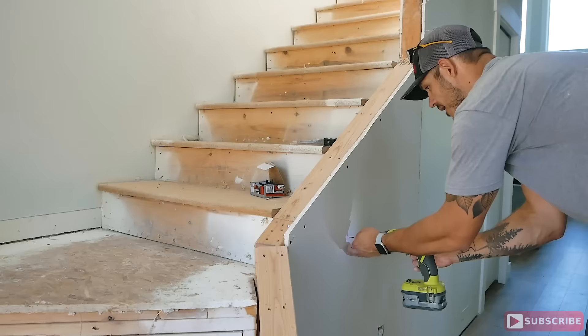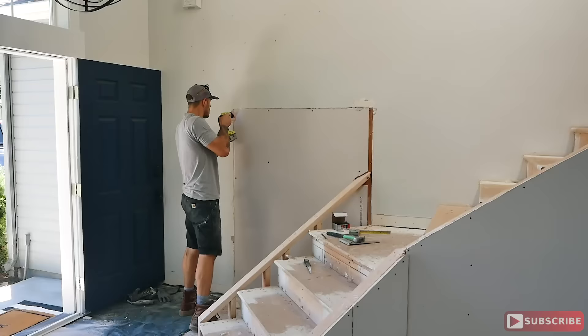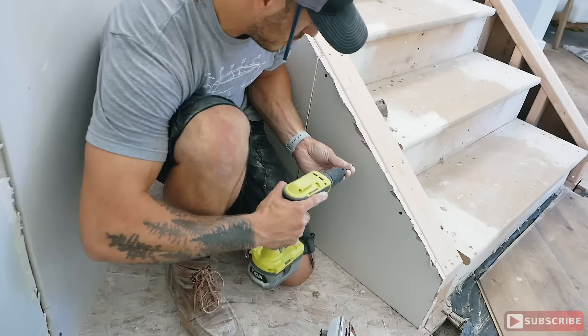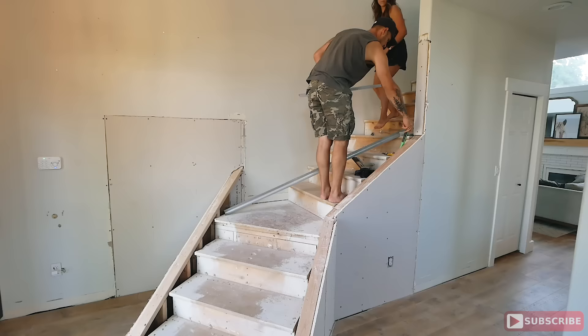The best way I figured out to do drywall cutouts is to take a piece of paper, draw out the shape, and then measure from every side to every corner. Then come out to your garage and trace that exact pattern. When it comes to speeding up the cutting process, use your utility blade with a straight edge — kind of like a level — on the white part, then flip it over and crack it, and it'll break exactly on that line. It's really fascinating and works a lot better than just using a drywall knife.